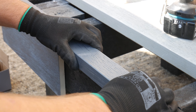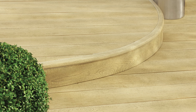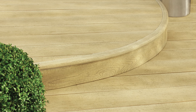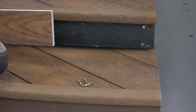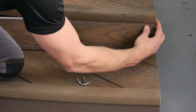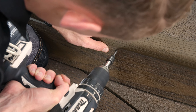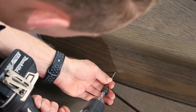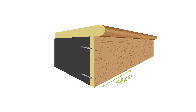If using the 50 millimeter wide edgings, ensure they are supported on a joist by a minimum of 25 millimeters. The flexible bullnose and standard fascias will bend to a radius of 1.2 meters. These profiles need to be at least room temperature or 20 degrees Celsius to bend to this radius. When fixing the flexible edging and fascia, start from the end with a double fixing point and work along, fixing at 200 to 300 millimeter intervals as you go. Some fixing holes may be partially visible. All edging and fascia profiles need to be fully supported along their length and fixed at 300 millimeter centers.